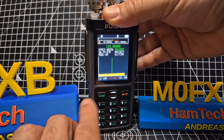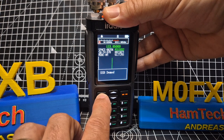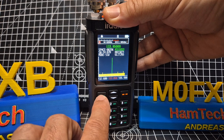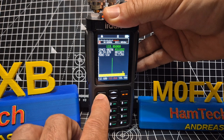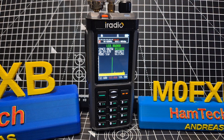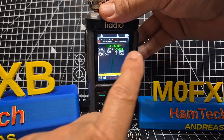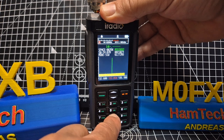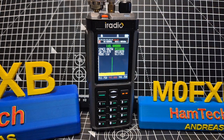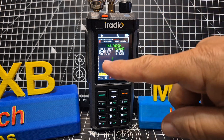You can actually change mode in the spectrum — if you press this flat button you can go to SSB. I've tested it on the HF bands and it's just not happening, but on say two meters you've got FM, AM, and SSB, which is pretty cool. Upper sideband on two meters does get used. Let's go to 145 MHz — and we're in SSB monitor mode now. You can change the squelch, change the step, change the mode.